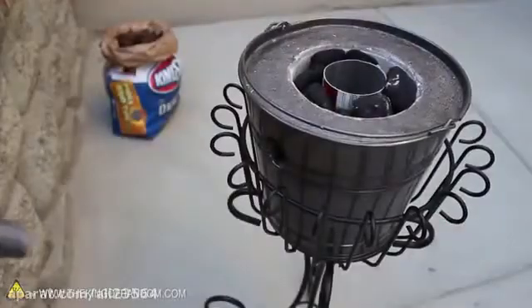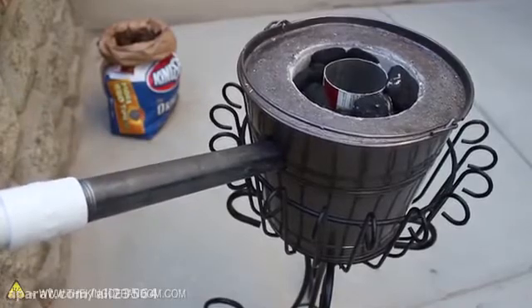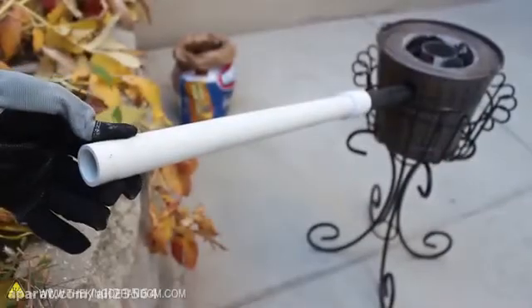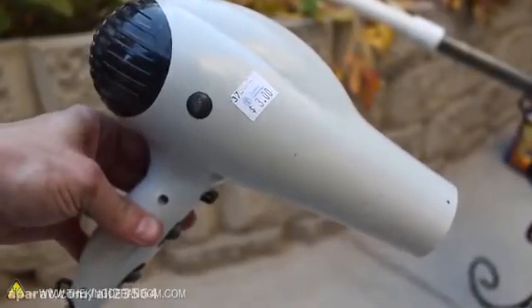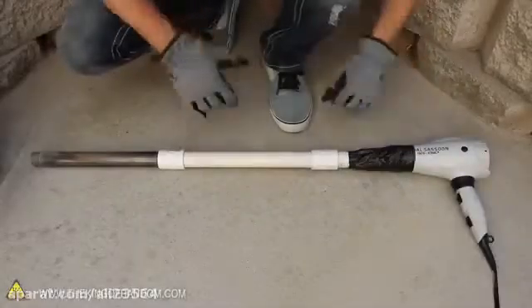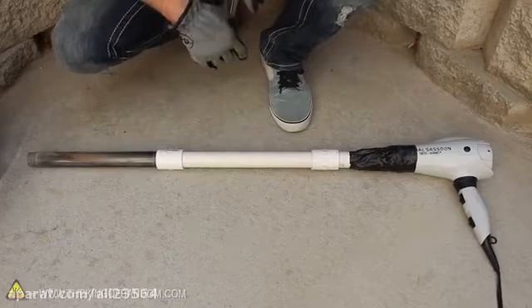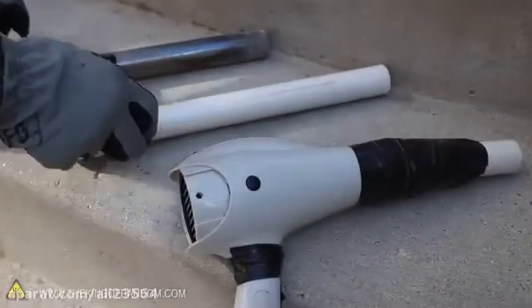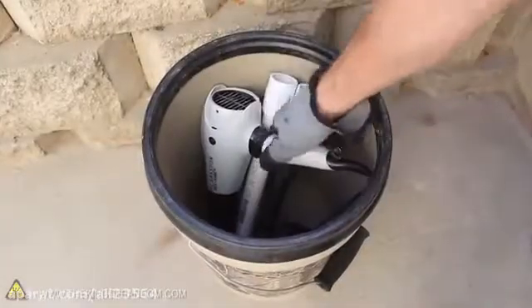Now let's connect a 1 inch steel pipe through the air supply port on the side of the foundry. This will get the fire hot enough to melt metal, but we still need a way to shoot the air in. We could just blow through it, but a much better idea is to use a hair dryer, which you can find at most thrift stores for about $3. I taped the hair dryer to some PVC pipe, and inserted a couple of 1 inch couplings to connect the steel tube at one end, and give the blower tube a quick release feature. This way it's super easy to take apart, and fits into a 5 gallon bucket for easy storage.